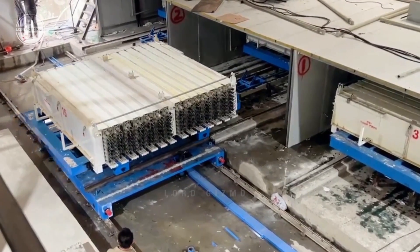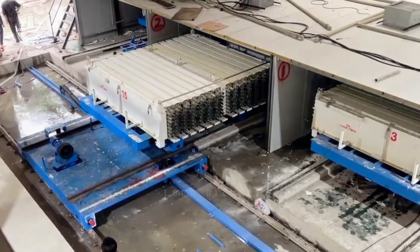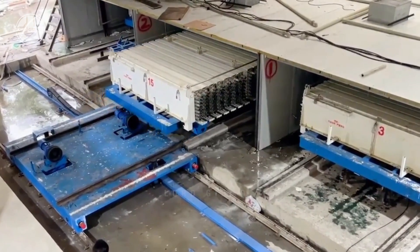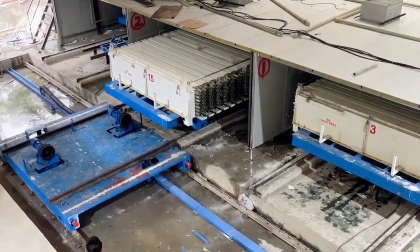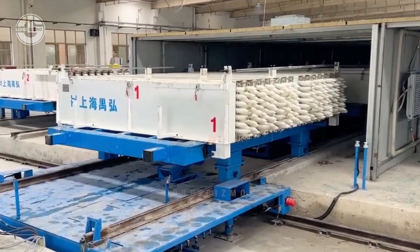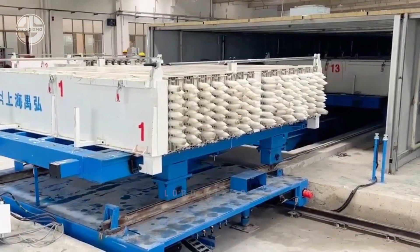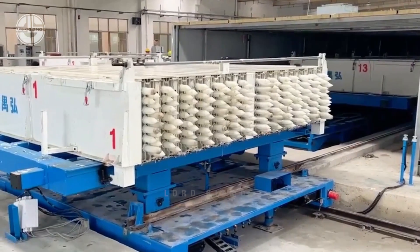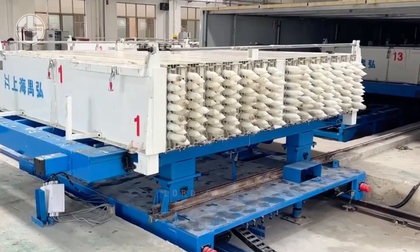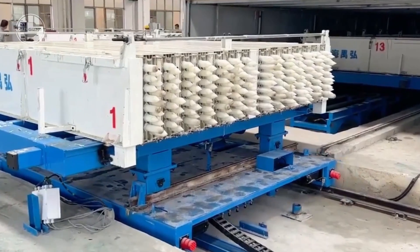Next, they still need to cure the mold and process it further. The whole set-up will be placed inside a chamber-like structure for it to completely cure and set. Throughout this process, workers monitor the temperature and humidity around the curing panels to ensure the desired result is reached. Since they are dealing with a large structure, this step is done entirely by machines and equipment. The concrete will continue to settle until finished, with the machine helping bind the ingredients together and giving the panel its strength.